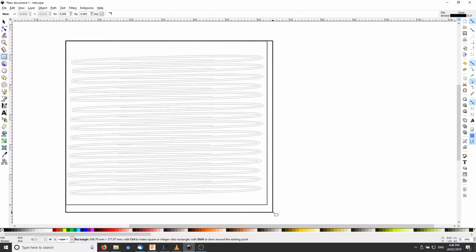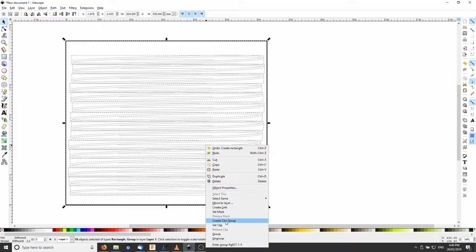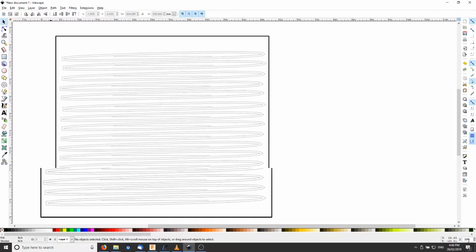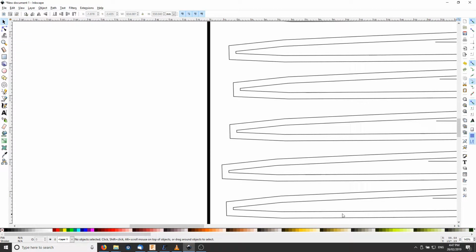So I need 30 of these, so I have to run 2 cut programs of this. Either way, that's how you get a DXF, the Exact Flat, from bases in Fusion 360, and then obviously I've got my 5mm seam allowance in here, which will be exactly the same for each piece, which makes sewing them a lot easier.